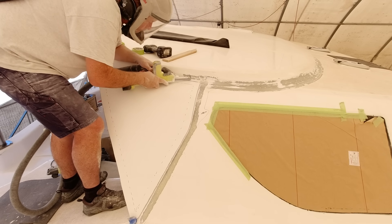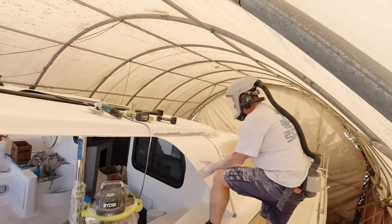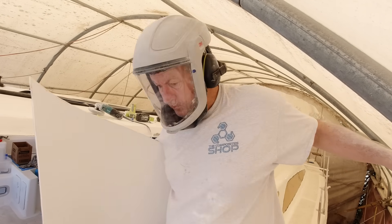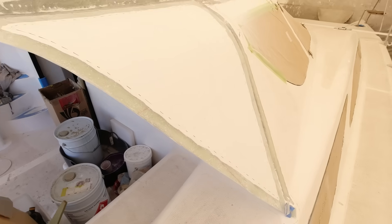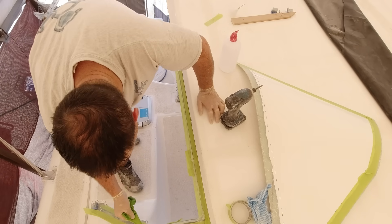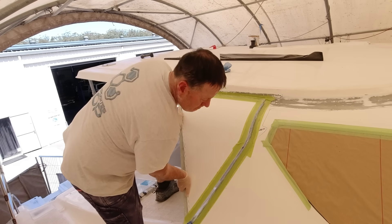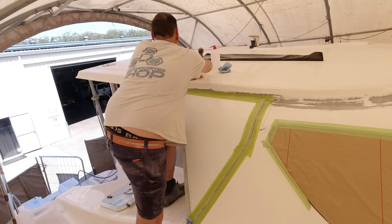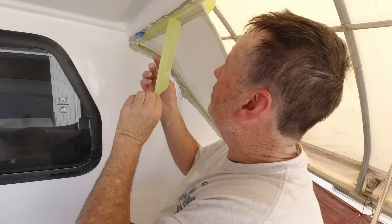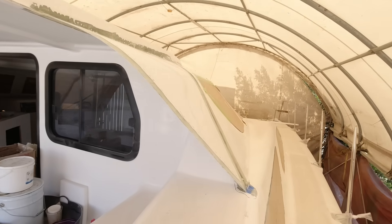For now I'm just going to get in with my sander and get rid of all this. Often I'll take the parts up to the factory and sand them down there as it collects the dust with the dust extractor and mitigates dust on the catamaran. I've sanded the margins of both sides of the parts ready to be tabbed and epoxied into place. I've masked the sanded areas to ensure I don't contaminate the tabbing surfaces with thickened epoxy. I'm then going to tab the margins with vinyl ester after the epoxy bead is set, so I can transfer back to the styrene-based system. The extra work in masking makes a massive difference — having an epoxy bond to the fiberglass edges, with the tabbing over the top, ensures the chemistry is unaffected.